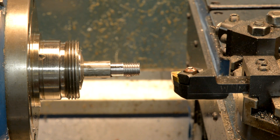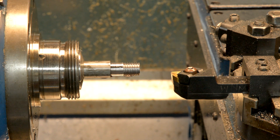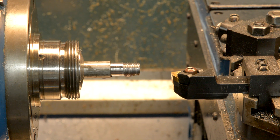We're going to do a little experiment here. Mach should be able to recut those threads in the exact same position as long as you haven't moved the material in the chuck or collet, because the pulse signal is always in the same position. This is handy — if it didn't cut the threads deep enough the first time, you can come back, change the tool wear, and rerun the program. It'll recut the threads deeper depending on how you set the tool wear. Let's see if it works — I'll go ahead and hit cycle start.